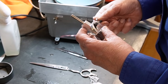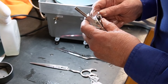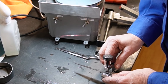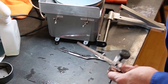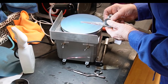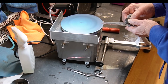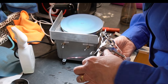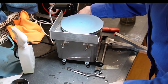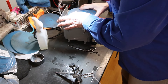Here's the trick: I'm going to set my clamp at 45 or 50 degrees — at least 45. Some of these high-end shears, and I don't think this one's ever been sharpened, I might be able to push it to 50. A lot of people believe in free-hand sharpening; I believe in a clamp because I know what my angle is. I'm coming in here, working my way down and rotating so that I get that convex shape. I've got a burr all the way down. This was at a worn 400 — I'm going to go to a worn 800 because I want this edge really smooth.